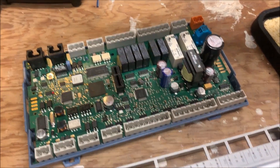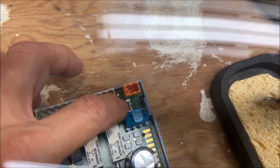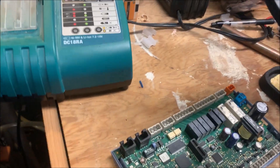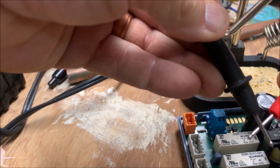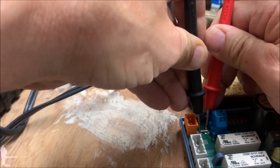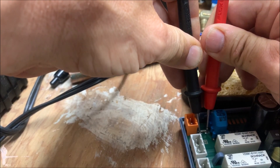There's no way you can salvage these things because if you look right there, there's the fuse — the onboard fuse — and I checked it out with my multimeter. I got the meter set up. As you can see, no continuity. So the onboard fuse is kaput.